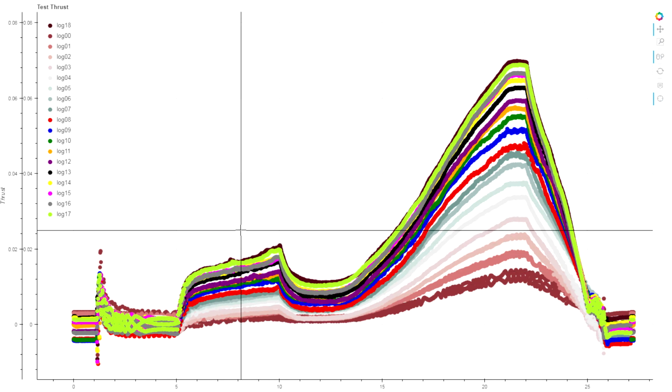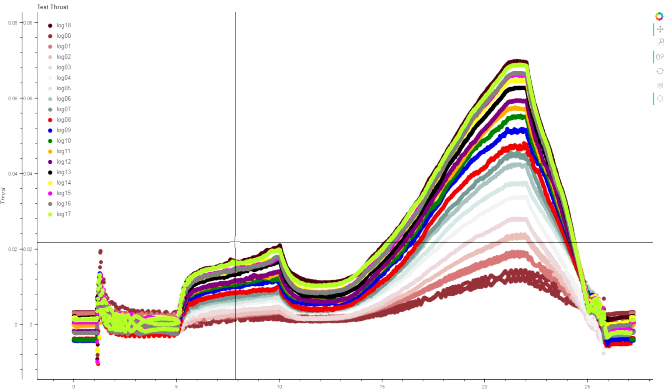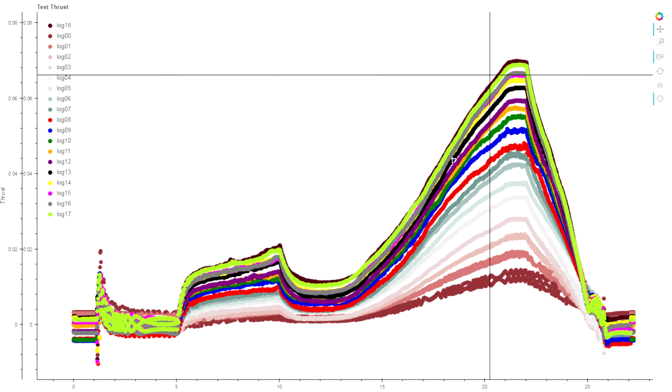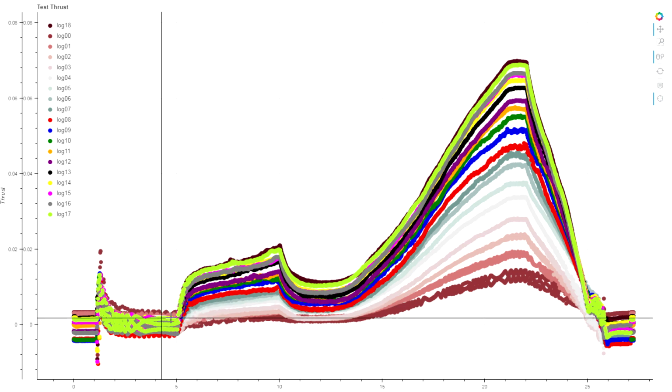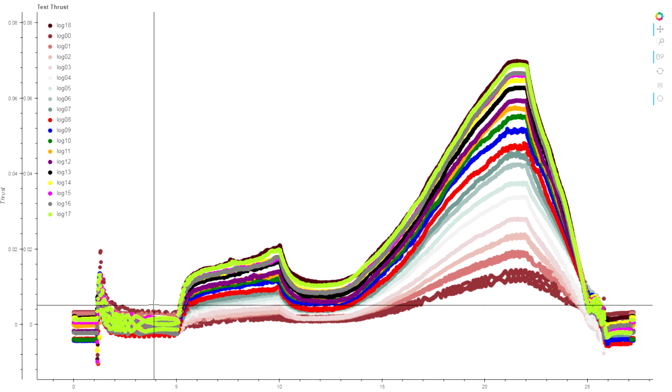There is an amount of drift that I notice running subsequent tests. Like, the margin for error on it is fairly reasonable, much smaller than the margin of error that we're seeing in these results here without this zero point calibration method like this. So I'm really curious if this is just related to the cheap HX711 load cell amplifier, or if it's from the no name, completely untraceable cheap load cells that I've gotten off Amazon.